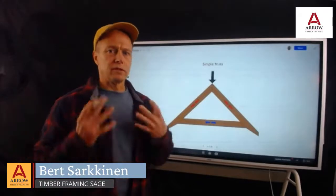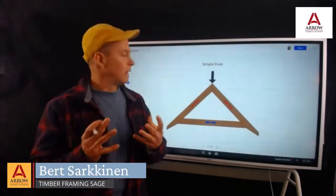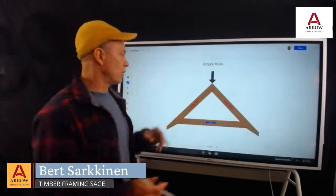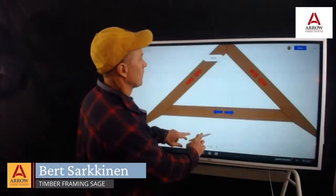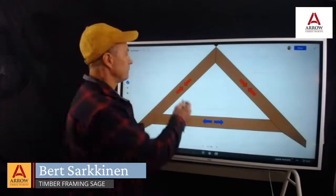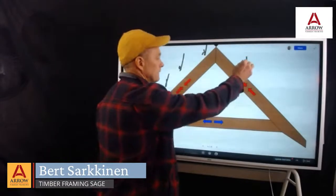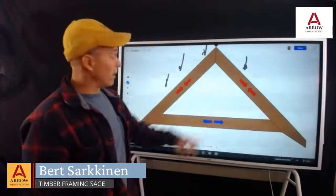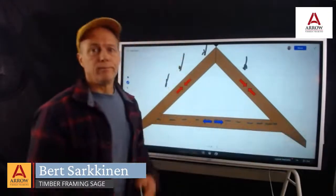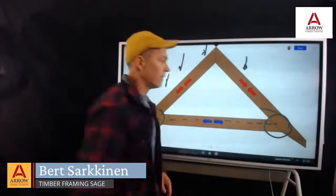So a lot of you may be aware of this, just the concept of a simple truss. You see the red arrows here. The red arrows are compression, and we've got our loads coming down on the truss. And the blue arrows, that's tension. So this could actually be a cable, just as long as we get a good connection here and there.